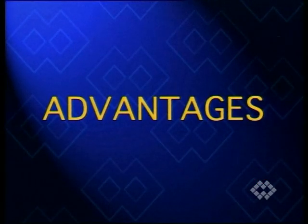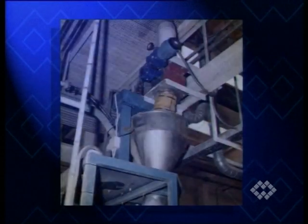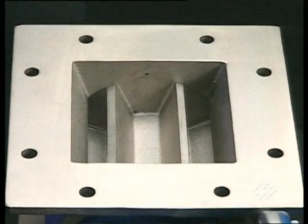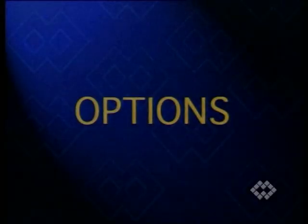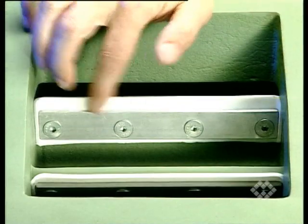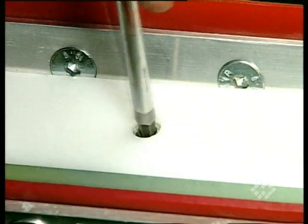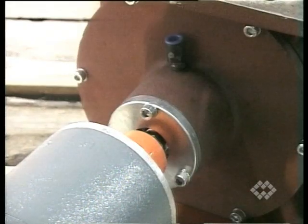In comparison with other feeding devices, our V-type rotary valves boast a few substantial advantages: space saving, sturdy, various materials and treatments available according to product handled, direct mounted drive without coupling, inlet and outlet flanges to WAM standards, scrapers made from different materials to improve sealing properties, and compartment inserts for sticky materials or feed rate reduction.